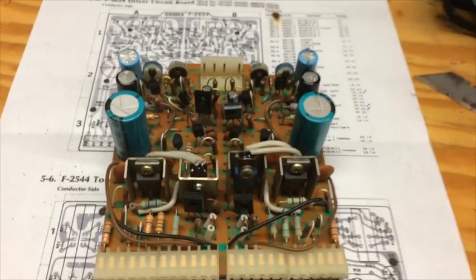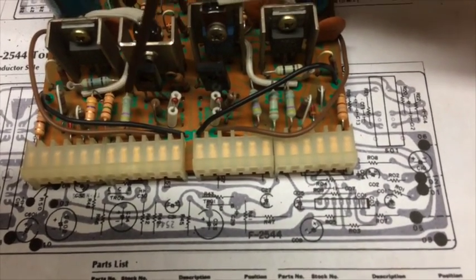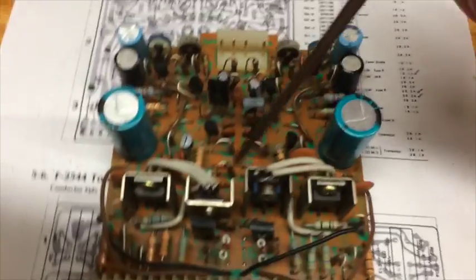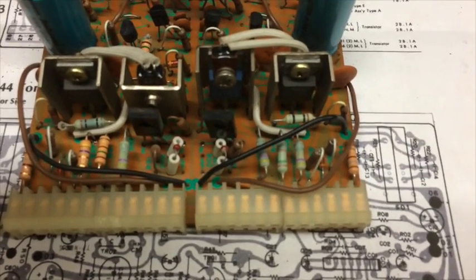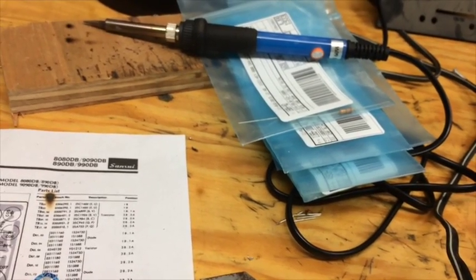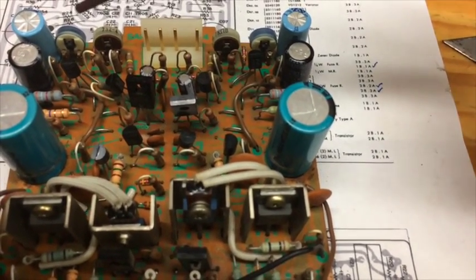After I operated on it, I'll go through here and show you everything that I've replaced. I tested all these resistors and the ones that I replaced were ones that were out of spec. I replaced these two — these were the ones causing the protector to not click in. Those are two 180 ohm resistors. All the parts, by the way, I bought from Digi-Key and I can provide a parts list of what I bought and what I replaced here.